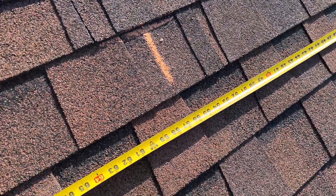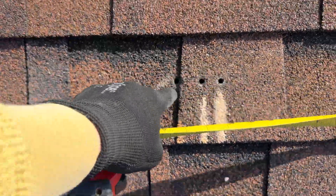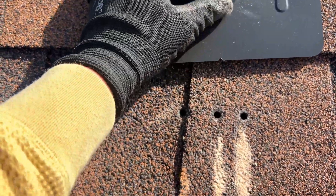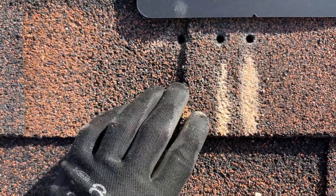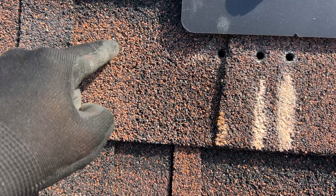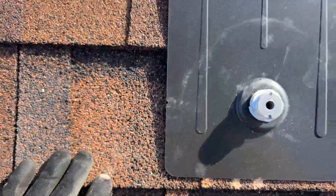In this case, rafters are not positioned ideally and we have 69 inches over the center, but it's supposed to be 72. This situation is fine if we have enough coverage for the metal flashing. In our case, the hole is there and we have enough space. We're going to seal all of this around plus seal all of these holes. Sometimes it's possible that you're going to miss a match — then we have to use just a metal sheet, insert this metal sheet and seal. But hopefully we're not going to be in that situation today.